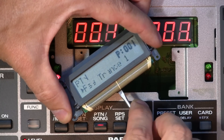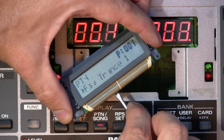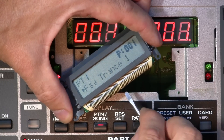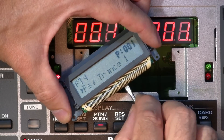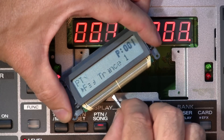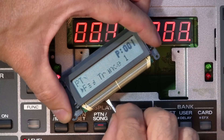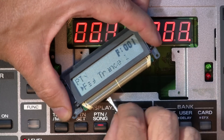As I move the screwdriver backwards and forwards just there, you can just see the A attempting to sort of light up correctly. I'm just putting a little bit of force on the back of this sort of zebra stripe type of connector here. What I'm going to try and do is actually heat that up and push it down as I'm heating it up.